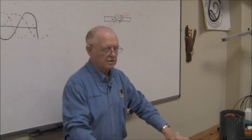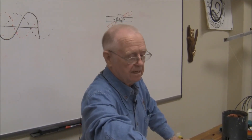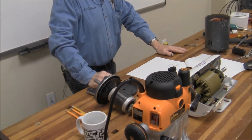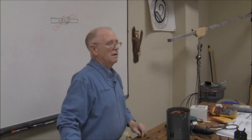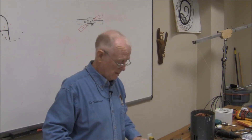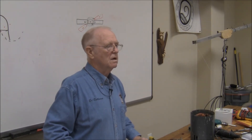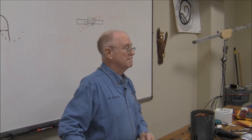There is a motor called a universal motor — it will take either DC or AC. You can tell it's a universal motor because it has brushes. Both the field and the armature are wired in series, which allows it to run on AC or DC. You're generally not going to find one in large horsepower sizes, but the brushes are an unavoidable feature.